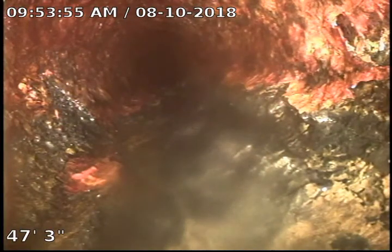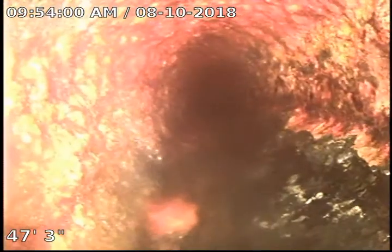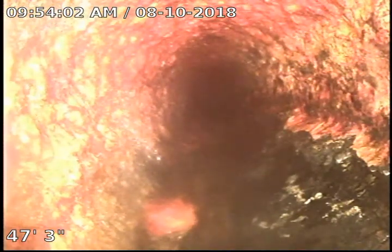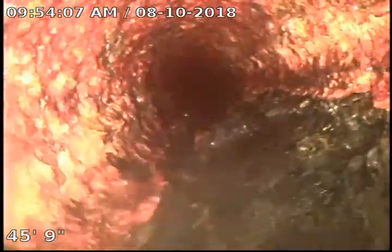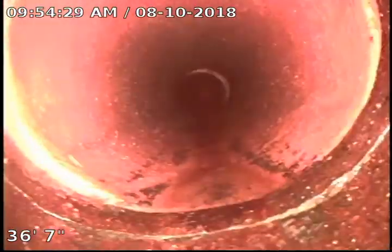We've made it past the grease, and this is the cast iron that is under the house. It's a little rough, but that's consistent with cast iron. We ran the jetter partway up under the house as well, just to clear any grease that may have been there. This is four inch cast iron, and right here is where all that grease was — you can see it's now gone. The pipe changes to clay terracotta right when it exits the house.